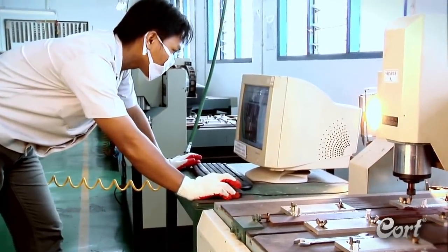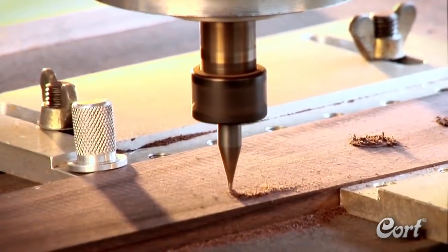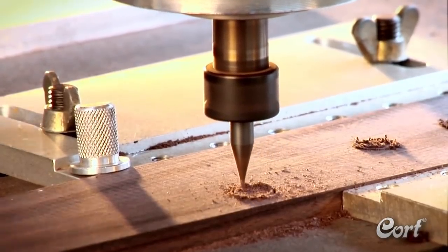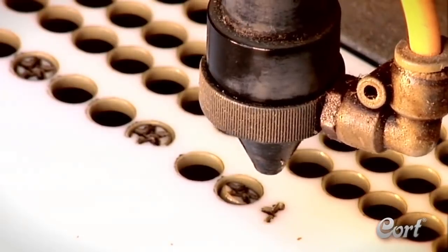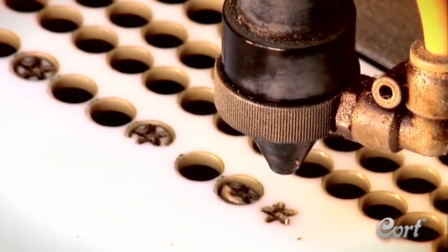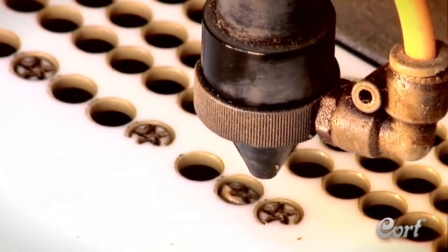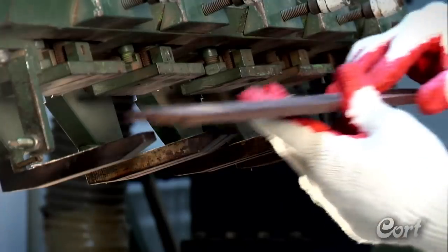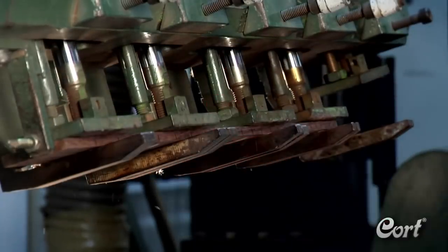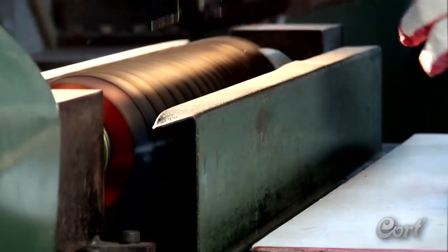Fingerboards on Kort guitars feature various inlay options ranging from simple to ornate. In each case, the process starts with the precision cutting of the fingerboard, done using specially designed compact CNC machines for maximum accuracy. While many other factories purchase generic inlay designs from an outside supplier, Kort uses inlay materials ranging from abalone and mother of pearl to plastic and exotic woods. These materials are laser cut right here in the factory. Another important part of the fingerboard preparation is cutting the fret slots — perfect fret position is critical for an instrument's performance and tuning stability. This machine, along with a highly skilled craftsman, ensures an exact result.